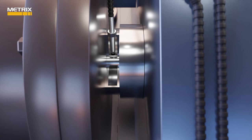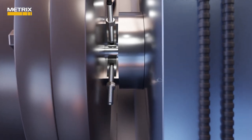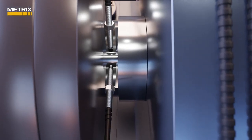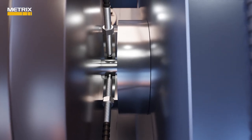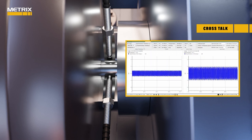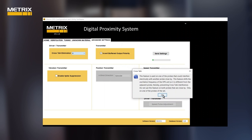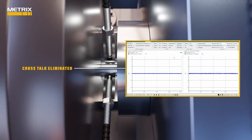In critical situations, a second MX8030 radial vibration proximity probe is mounted in the X horizontal direction, providing a better picture of the vibration of the rotor associated with the impeller. Due to the closeness of the proximity probes, one may experience crosstalk between the probes, like two radio station frequencies close together. Crosstalk can be observed when you have vibration with the machine not running. With the Metrix digital proximity system, you can alter one of the probe's oscillator demodulated frequencies using the free DPS software to eliminate the crosstalk.